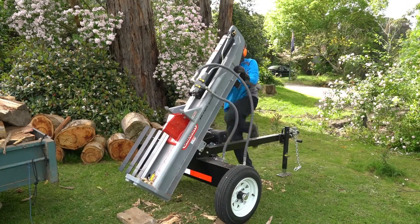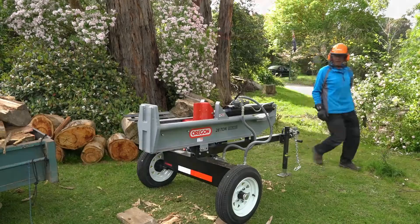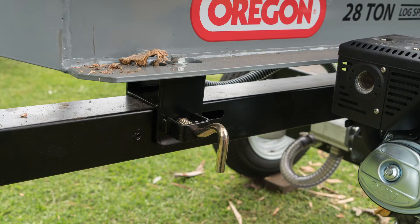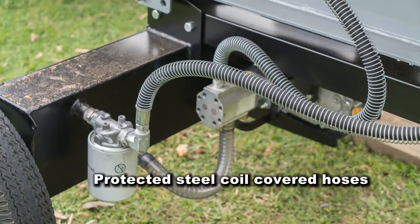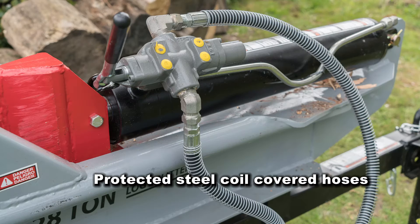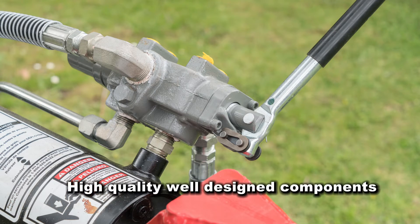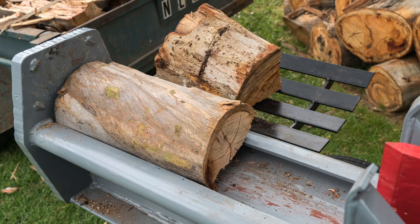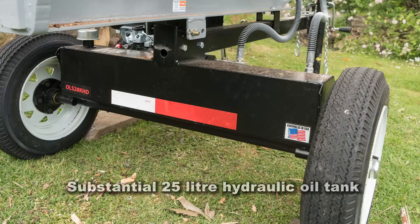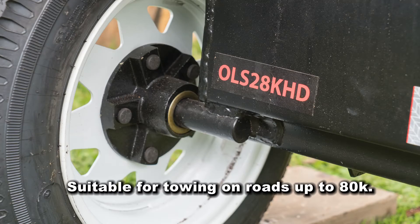Other interesting things were the simplicity of design — the actual fulcrum was in the middle balance point for tilting the machine. Everything was really well made, which made the choice of buying this machine an easy one. You can see all the hydraulic pipes are nicely covered in wire coil. Everything is substantial — the control lever, even the design of the actual head. That had no problem penetrating all sorts of quite difficult hardwoods and gum trees. It has a very large hydraulic tank and good, strong bearing axles.